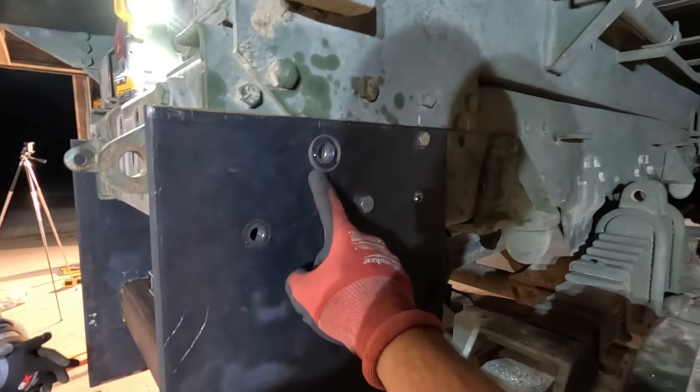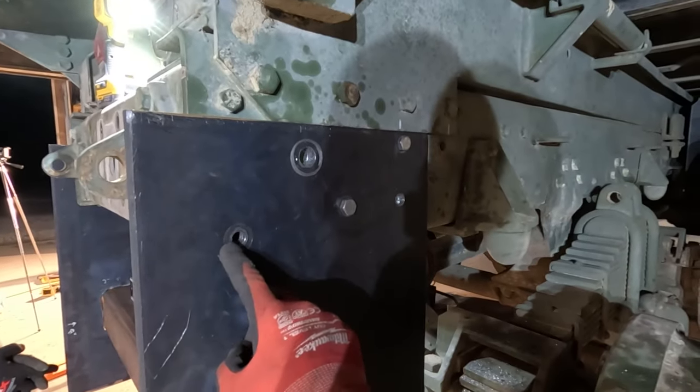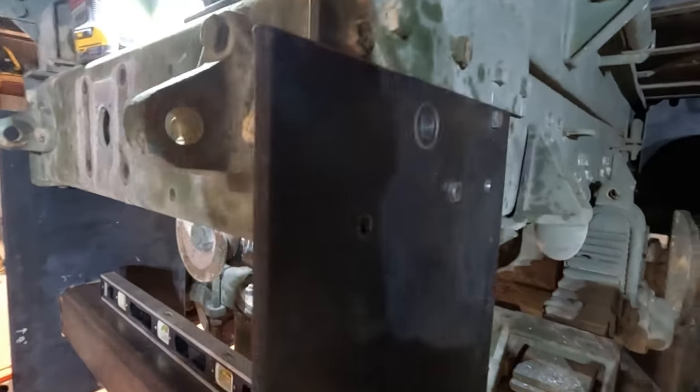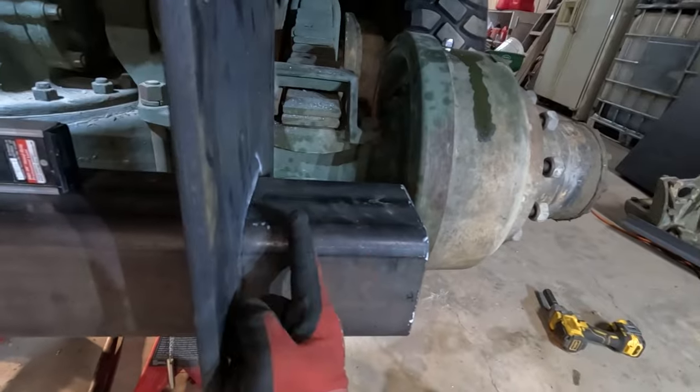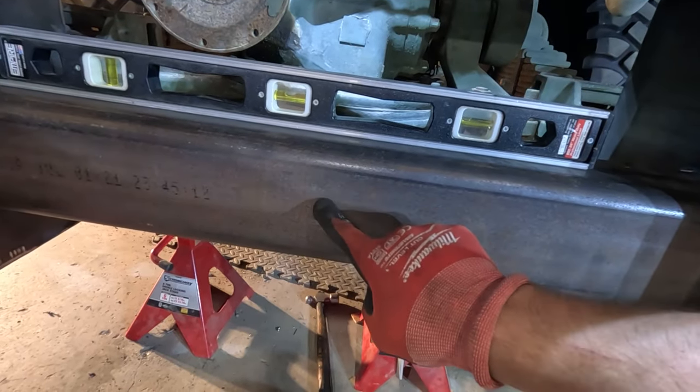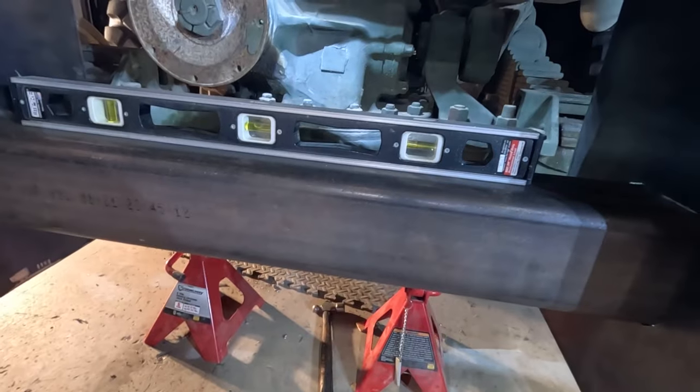Other side has 2 3/4 and 3 1/2 inch holes, but 1/2 inch, 1/2 inch. And so that is a lock nut on the inside. And then I'm thinking we're gonna weld all around both sides. We'll leave it sticking out. Instead of the 2-inch receiver or shank, whatever you wanna call it, it's gonna be 2.5. So it should be a bit stronger, and that's a thought.